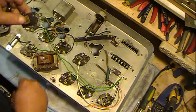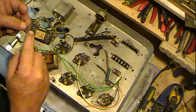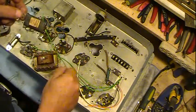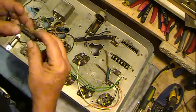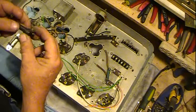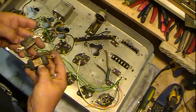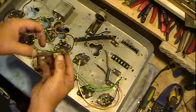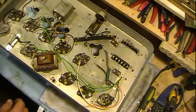You get it started and you just unwind it, get the two ends out, connect those, solder those back onto a new cap, which more fits in here easily. Glue the pieces back together, and then just some hot glue on each end to fill it in, and that's all you've got. Ends up basically a stuffed capacitor.